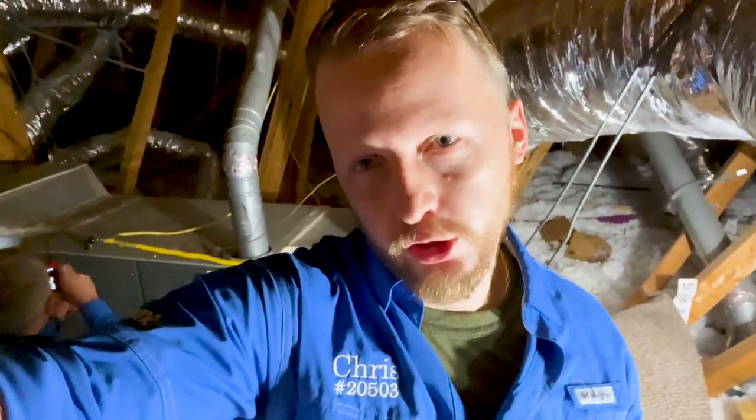We're in the attic space and you can hear that behind me. If that's happening in your attic, you should probably check it out. What that is, is a blower that's off balance — an off-balance blower will reduce the life expectancy of your HVAC unit. It's pretty easy and cheap to service at first, but if you let it go on forever like that, it will die pretty quickly. That's find number one.